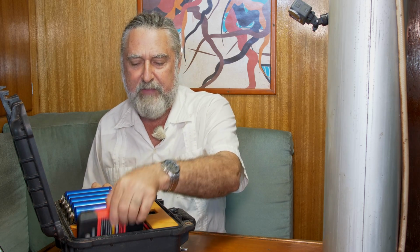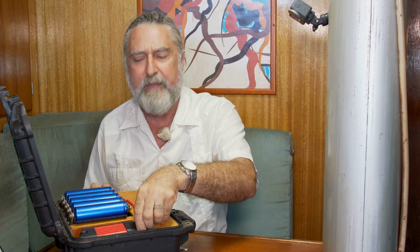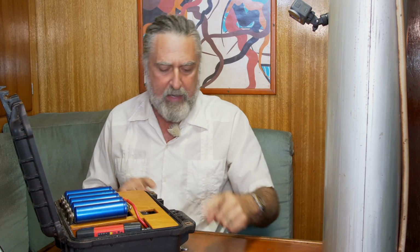We usually carry something in this little wasted space. Right now we have a little inverter in here. That's handy. When Emily went out, she would put a VHF radio in there. And then there's this big circuit breaker. And when you turn it on, now these poles are hot. And when you turn it off, the poles are cold. And of course, if anything bad happened, it would turn itself off, circuit breaker. Under the wood here is the BMS and an active balancer and all the things a battery has. So we'll go into that in detail.